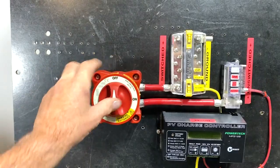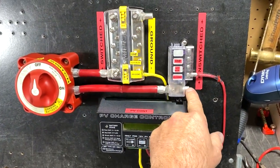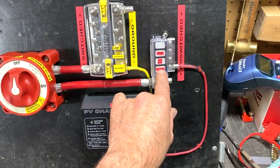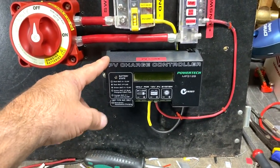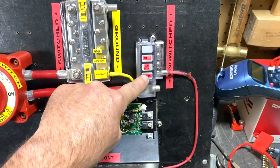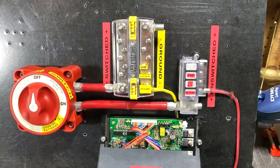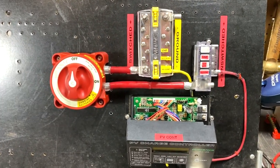I'm making good progress on my circuit board. I've got the main switch — the battery isolation switch. It will be fed through here and run off to the battery. This is my unswitched loads: the solar panel photovoltaic controller, the auto bilge, and the VHF. I've got my solar charge controller here, and I've just checked — there's a 30 amp blade fuse inside it. I currently have a 15 amp fuse here and I'm just checking what the 6mm wire can handle, and thinking about how many amps are going to be pushed through the panel — I think it's a maximum of about 11 anyway.